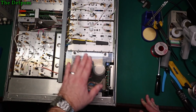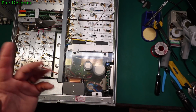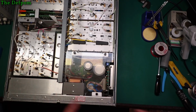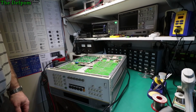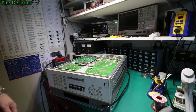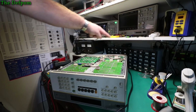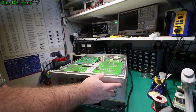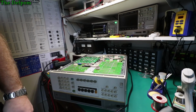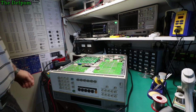Right, so it's ready to flip this thing around and power it up. I'll get the scope set up, I'll change the camera angle, stuff like that, and look at the scope, and we'll reprobe the capacitors to make sure they look okay. Okay, so I've got the power plugged in. I'll turn it on first, just check to make sure things light up okay. No flickering or anything like that on the display first. Then we'll probe the capacitors and double check. And it helps if I actually turn the power on first. Hold on. Waiting for my Variac.